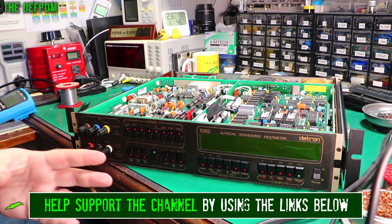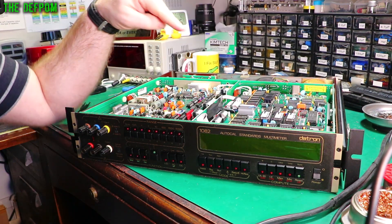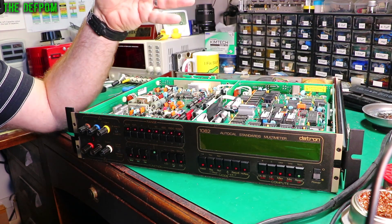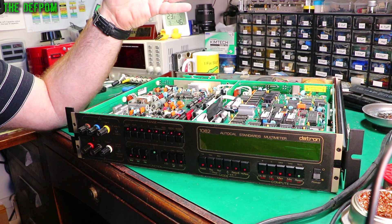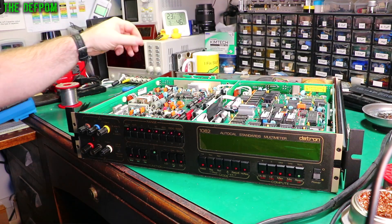Because of my experience with the DATRON calibrator — the 4700 — I'm also looking at tantalum caps, because in that unit they're known for having lots of problems with tantalum caps blowing. I believe that's because if the supply starts to fail and the caps start to go, it puts a lot of ripple across the power supply and then blows the tantalums out due to high voltage and noisy ripple without enough headroom.